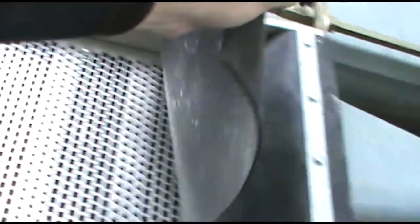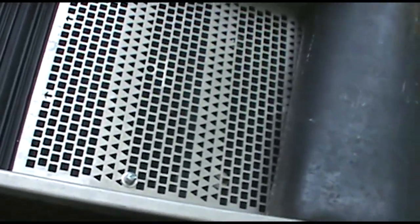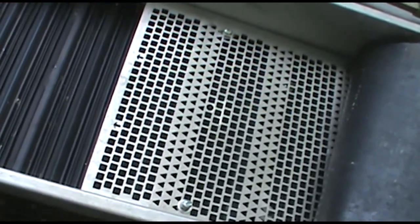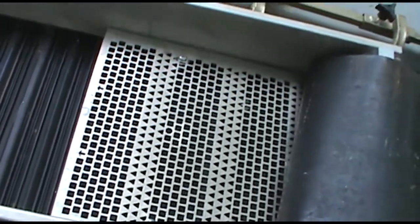Alright kids, we're back on the river again. And we're going to do something that we didn't do in West Branch, and that was this. With my hog mat, I did not run that classifier. My bet is I blew a lot of gold out just because I had too much turbulence in the mats. Even though it looked pretty smooth, I still think it might have been a little too turbulent. So we're going to run it again and see what happens.